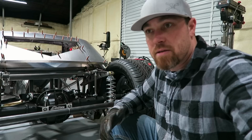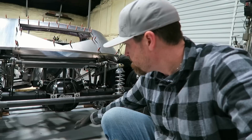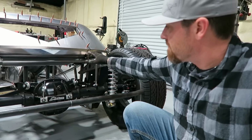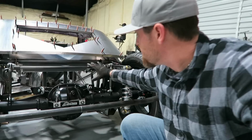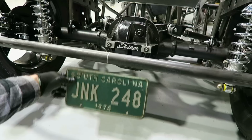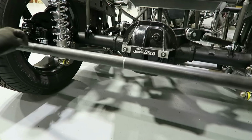So this thing will come down, probably have some diffuser plates in here, maybe make a pan under this thing. And then these pieces will come out and tie in, and I'll sheet metal all this in. May even do some kind of vent that comes out from underneath the radiator. I haven't really worked that out yet, but I may have a vent piece that comes out the back. I don't know. I think what I want to do is maybe put two more bends in this thing, just really little ones. So the recessed tag will be here. I may do a bend just on the outside of each tag, like a 5 or 10 degree bend, to give this thing a little out flat and then a little bit in, just to mix it up a little bit.